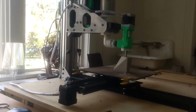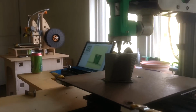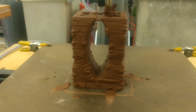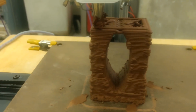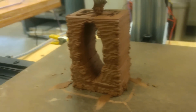And one of the things we think about all the time is how the clay gets from where it starts to where it ends up as part of an object. And to make that pathway a pathway of very little resistance, and to try and avoid any kind of bottleneck or any kind of unnecessary friction along the way. And so through experiment after experiment, we ended up with elegant prints and really inelegant prints like this one that just has all kinds of lumpiness to it. But the whole point here was to work with a fairly stiff clay that we might just be able to make this kind of bridging form that would arch right over this opening. And while this looks terrible, at the time, it felt like something significant.